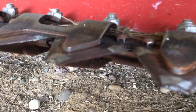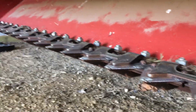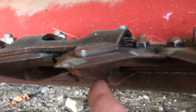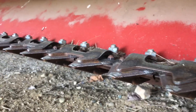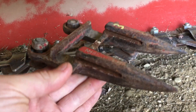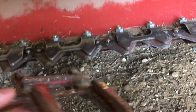The knife needs to be held down tightly against the guard by what's called hold-downs. I have what's called a stub guard on this mower, which means there really isn't any guard sticking out beyond the blade — the guards are short and stubby. These types of guards are great if you don't have a lot of rocks or other things in your field because they don't plug. The other type is called a standard guard — it's a little longer, has a slit where the knife moves back and forth, and sticks out much farther.